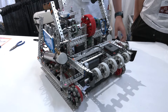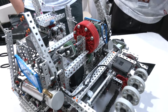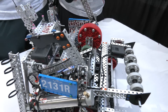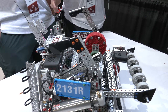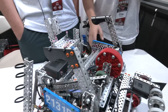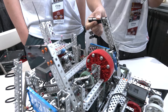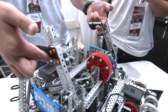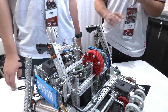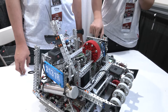Let's talk about the dog gear on your mechanism, Caleb. So we'll start with the dog gears. They're a super simple hanging mech, and it's something that doesn't require any pistons or motors to run off of — kind of a last-minute solution. We need to hang, and it's an extra 20 points max, which is really helpful in this competition. So we just drive up to the bar. This rounded section pivots our robot up so it can lift the robot up just like that, and then we hang directly there on the center. It's right across the center of gravity on the robot, and it gives us a really good hang super fast. If we need to drive under the bar, they fold down, and they're just rubber banded back up. So it's pretty simple.